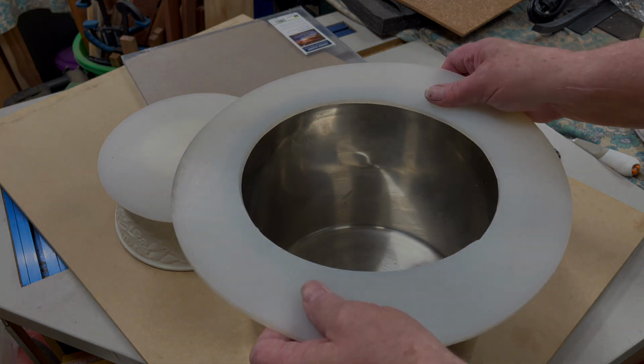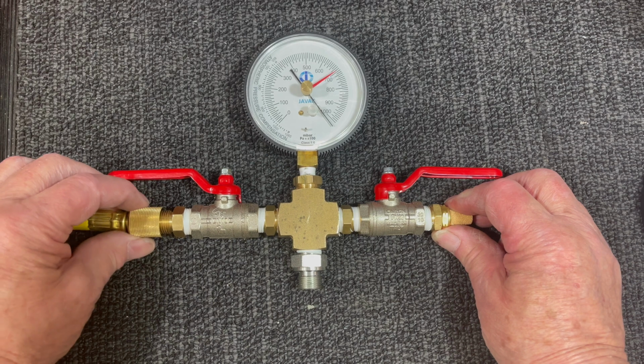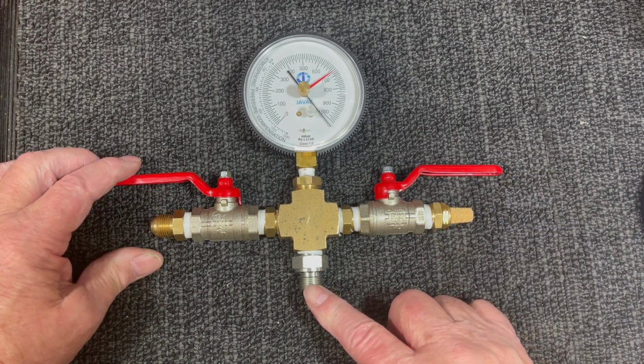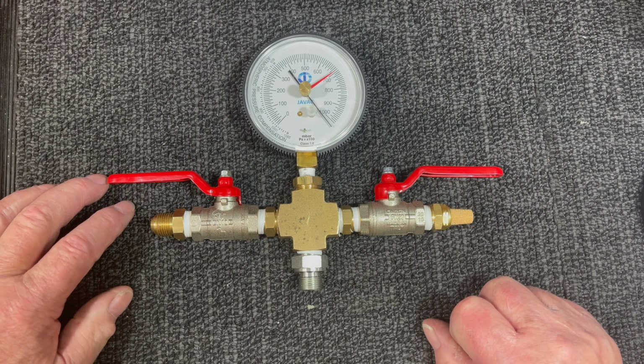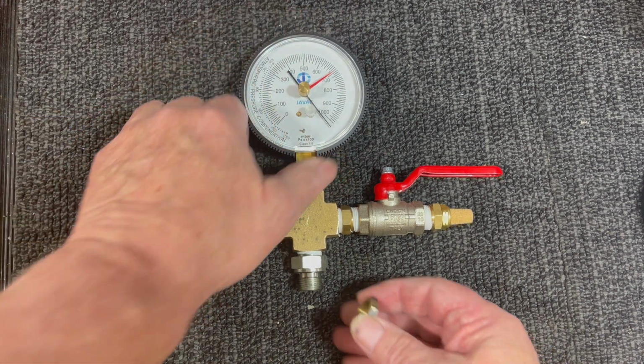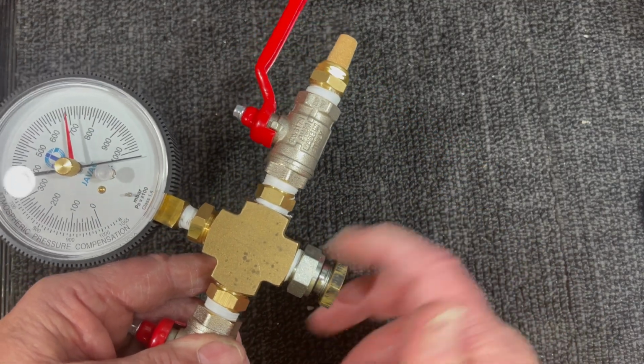The tank will connect to the pump and have two isolation valves, one between the pump and the tank and the other to allow for initial pass-through of air and then to seal the system from the outside atmosphere. It also has a filter installed to allow it to be used to bleed air back into the system at the end of the degas cycle. The gauge will sit on top of the tank and be mounted between the two valves. This will register the amount of vacuum in the tank.